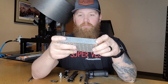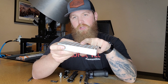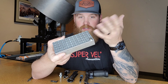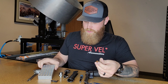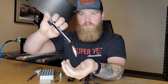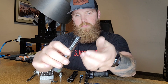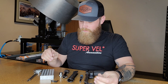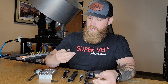This check block is tighter than any chamber I've found on the market, so when ammunition passes it, I know it's going to fit your gun. This is one of the tightest chambers on the market and it freely drops in. Listen for that plunk and watch for it to freely fall out — that way you can ensure smooth feeding and smooth extraction.